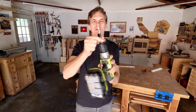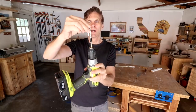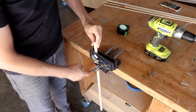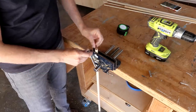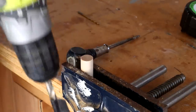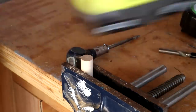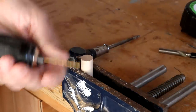What I've done is flagged a piece of tape on my drill bit to mark the depth, and I'm going to drill maybe a half inch deeper than the length of that pin. Since it needs to be that deep, it's going to be tricky to keep it going straight, so the best solution is to first drill a pilot hole with a smaller bit.